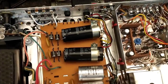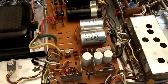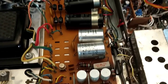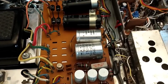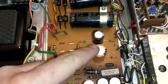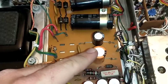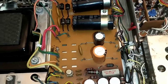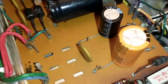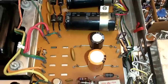We've got both large caps soldered in now. They're both happy — the brackets are holding them in place, nice and stable. Now it's just a matter of cutting out the smaller guys and replacing them with radials, maybe with a little adhesive to hold them in place. We have a 1050 microfarad and a 470 at 100 volt replacing a 500 at 80 volt. In both cases the new cap leads were too short, so I made loops and soldered them to the existing leads.